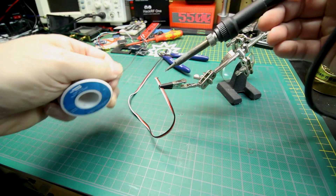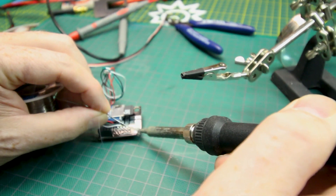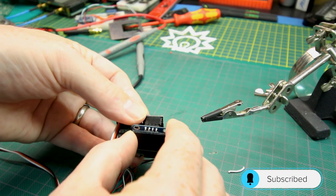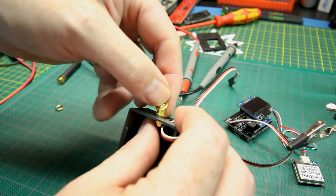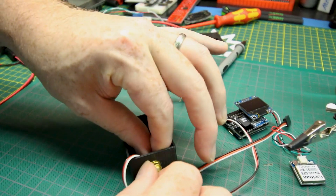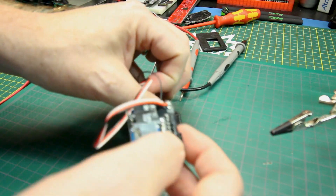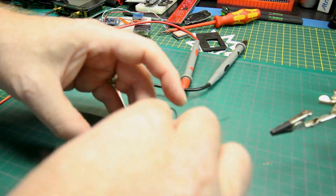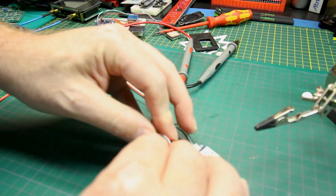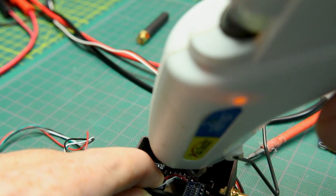Solder up a cable so that this can be fed power and ground — in this case it's just a servo wire. We're going to be hooking this unit up to the flight control in the aircraft. On the Wemos D1 I believe it's three to six volts DC in, but you can always add another regulator or different battery setup. Feed the antenna connection out the side and nut it to the side of the enclosure — that'll hold our 2.4 gigahertz antenna on, no problem. Because I left all this extra wiring, it's a little bit of a fight to get it to sit into the enclosure, so I just mess around until I get everything to fit. A little dab of hot glue to hold things in place.